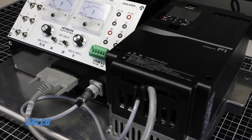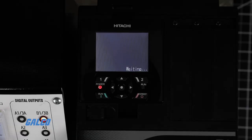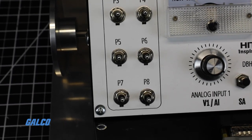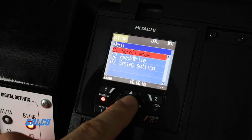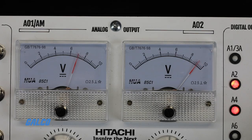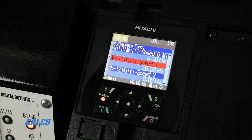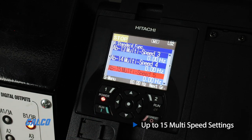With the P1, running a drive at a different speed automatically is as easy as flipping a switch. For example, we have a switch wired to input terminal 8, the P8 switch on the digital inputs, and we can program that terminal at parameter CA08 to look for a multi-speed setting. The multi-speed setting is programmed at parameter AB11, which sets multispeed 1 to whatever frequency you need for your application. You can set up to 15 multispeed settings.